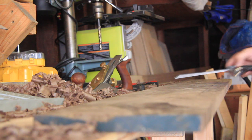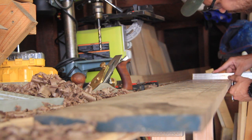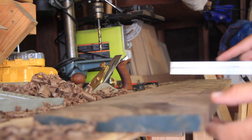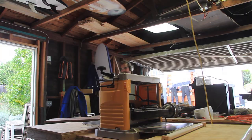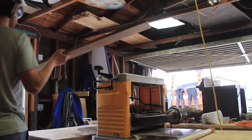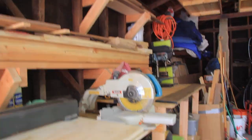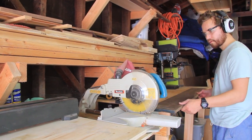It's a good idea to check the two faces that you squared up with a square, and if the whole process was successful you should have a square fit for those two faces. Then after that I ran the board through my bench top DeWalt planer — a 12-and-a-half inch planer — with the hand-planed face down so it's flat, and it planes down the surface turned up. Then you can use that straight edge from the joiner up against the miter fence when you do the different cuts with your miter saw so they're square with the edge.